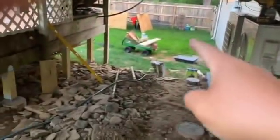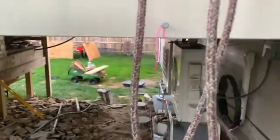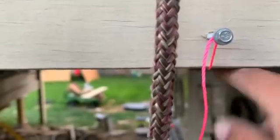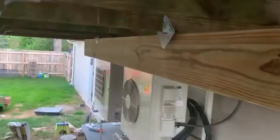To carry that two-by-eight - which is fairly heavy because it's still a little wet - I made a little rope loop here. This will act like a second person for me. It measures about nine or ten inches in length and I wrapped it around the rail so I can adjust accordingly. Since this part is flush, as long as that's touching there I'm good, and I can work on the other end while this end is held. I also made a secondary tie so the board doesn't fall off the rope loop while I'm working.